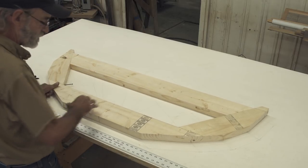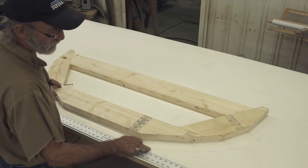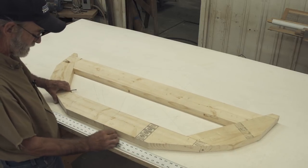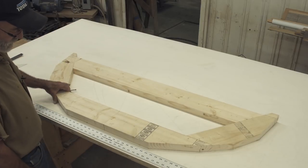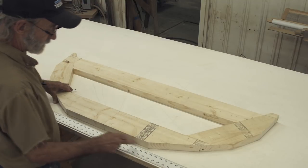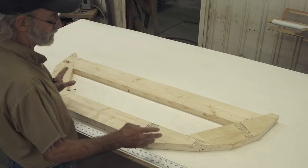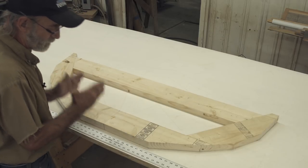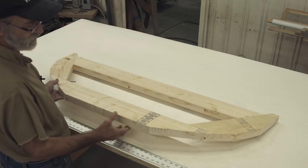This would be number three, the one in the very center of the boat — midships. You can see it's made to line up with this line right here. All I have to do is move it into position and you can see it's a copy of that set of lines on the table. I drew both sides of the boat on the table so I could copy it like this. There are probably 50 different ways of transferring lines from the table onto the mold, but I've got my own method and I'd like to show you how I do it.